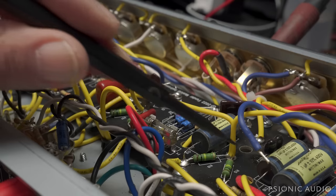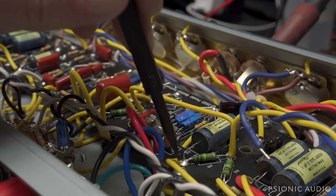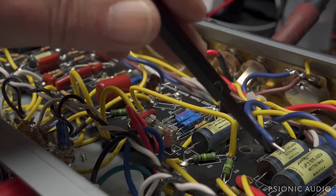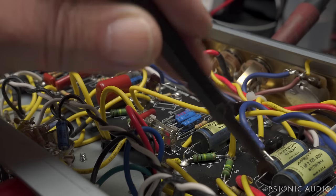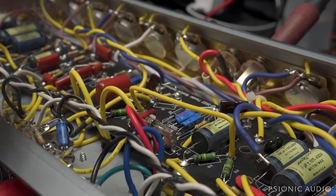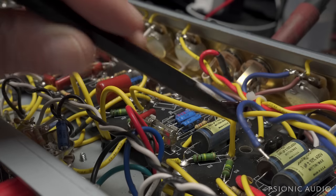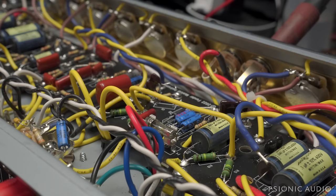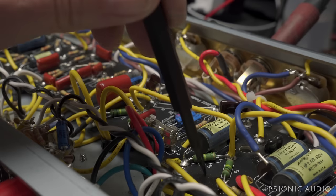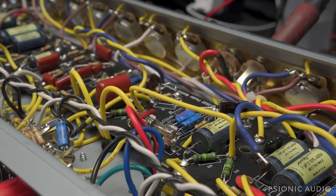And you can see that I have disconnected this blue wire here from this plate that goes to this plate. It can be reconnected. I'm going to tape it off with some heat shrink and tuck it away, because that's got live voltage on it. We don't want that for someone to touch, or for it to accidentally touch the metal shielding inside the cabinet when it's all put back together. So I'll just tape that off. After talking to the owner, make sure he understands that doing this makes this channel sound really good, but it totally disables the previous channel.